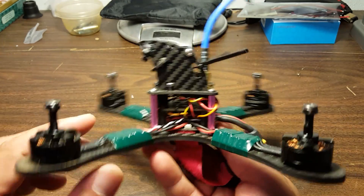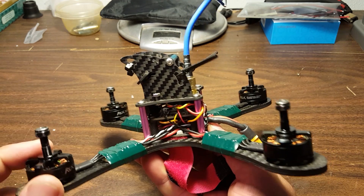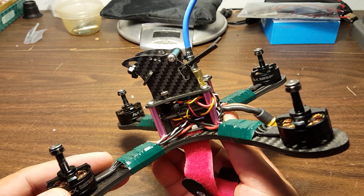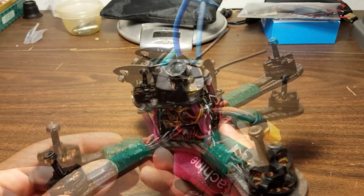I've got the antennas very short, and I do like to keep my antennas pretty short. Keeping them short may reduce range slightly, but we're not really going for range with an FPV racing quadcopter — we should get plenty of range — and it helps keep the antennas out of the props.